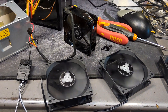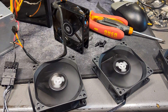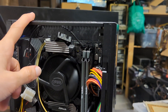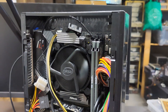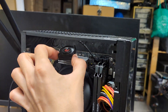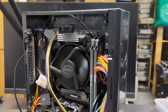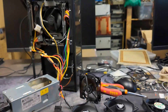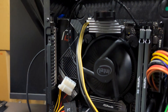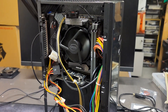I had to place three fans on this using another adapter. So just to show you — you can get this kind of PSU to turn on using three very slow fans. I would place those two fans on top here on this ML05 case. This tiny fan is also very noisy and I need to find a solution for it too, because I want to make the whole build very silent. In total I'm going to have six very slow fans inside this computer, which will make it run silent in the end.